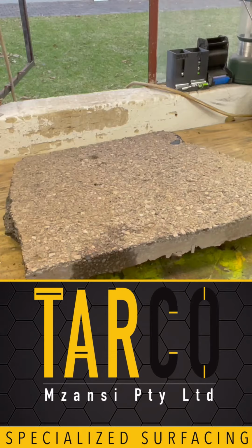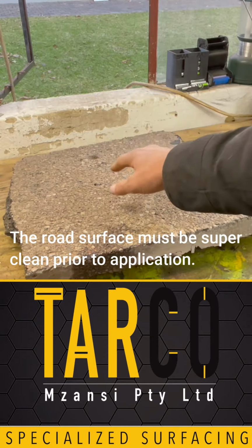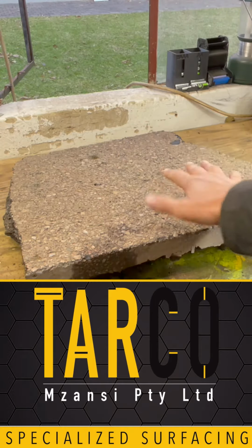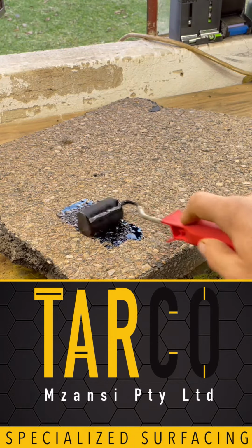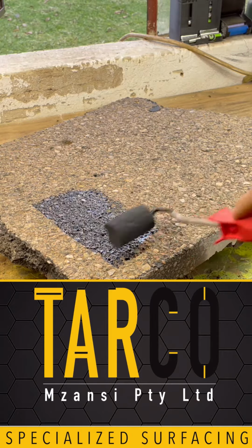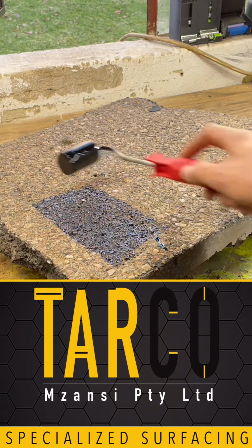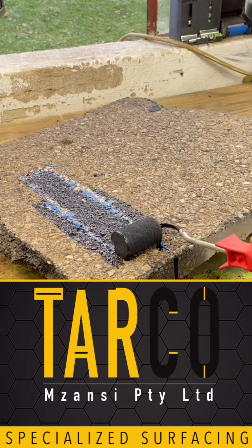So before we rejuvenate, we have to clean the surface of the road, take out any embedded grime and dirt. Any oil spots, any soiling of any sort needs to be removed. When we place the rejuvenator, you can see how quickly it's going down. We would want to have it saturate in front of the roller so that it can access everywhere.